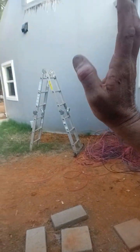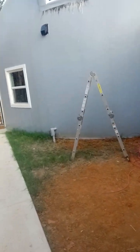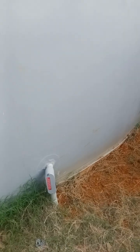I didn't want to trench over to this dome — it's made of concrete with reinforced steel, pretty much like Superman's fortress. So I had to figure out a way to get in, drill or pilot through the concrete slab, which is pretty thick. Instead of digging through, we went up from the junction box and ran PVC right up underneath the gutter aspect — the gutter's already protected, sealed and everything. Then we came down with flex to the main system, around the back end with sealed flex, and came in through this main junction hub. This was already in place for main incoming power, and we basically had enough line space available to do that.